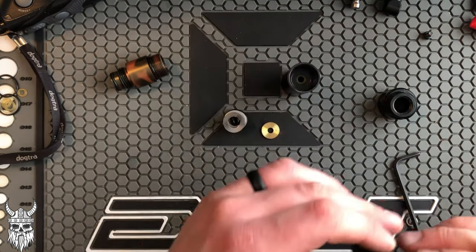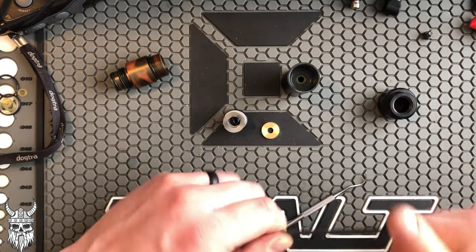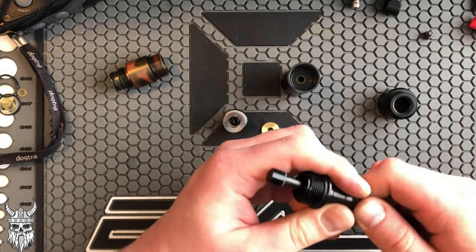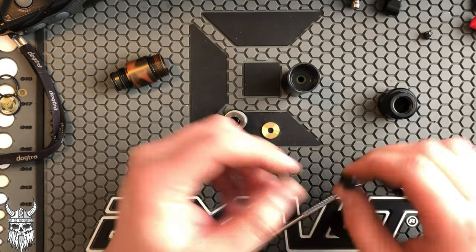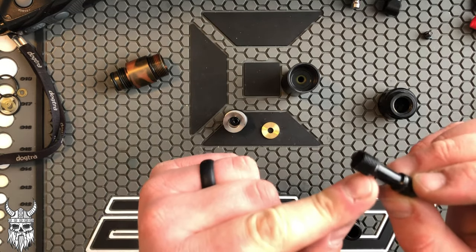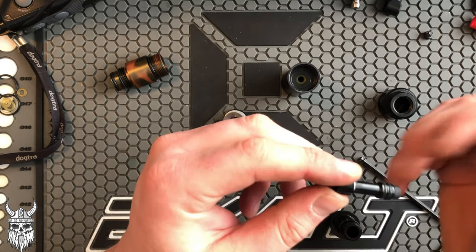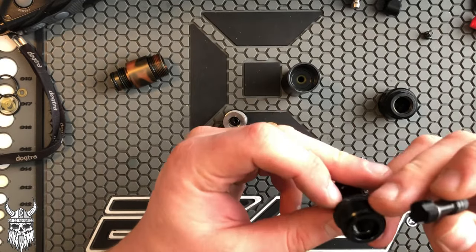Actually, let's not start removing O-rings yet. Let's pull out the seat. Like I said, this drives all the way up and out. Yep, looks like somebody tried to remove it by just driving out the... or turning this out. So, doesn't work.